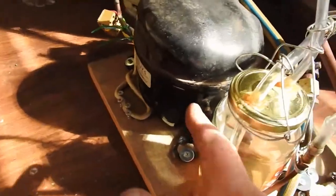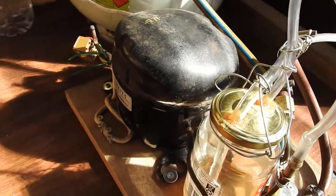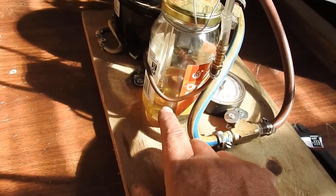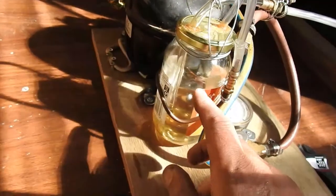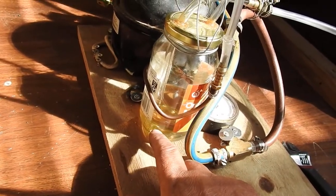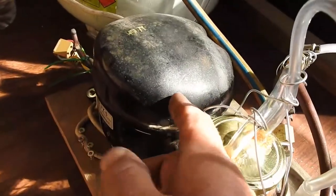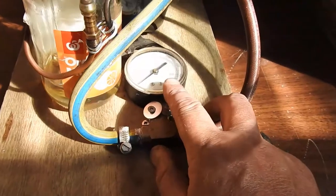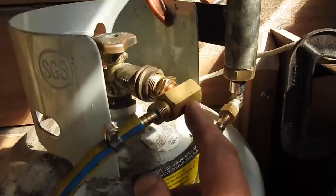What I've got is a refrigerator compressor — that's why my beer is no longer cold. The intake to the compressor is fed through a bubbler with a bit of diesel in it. The idea is that the vacuum side of the compressor will pull wood gas through here after bubbling it through the diesel, which should get rid of particulates and also lubricate the sensitive confines of the compressor. The gas stream is then fed through this gauge and out to the connection on the LPG tank.